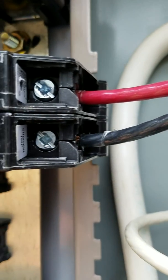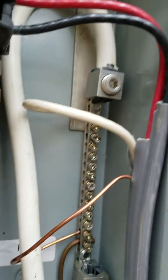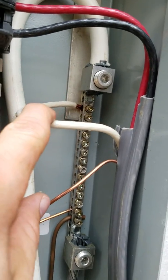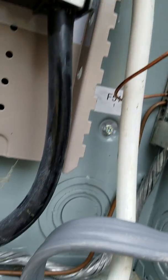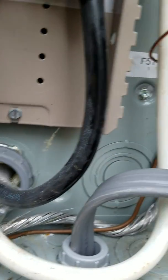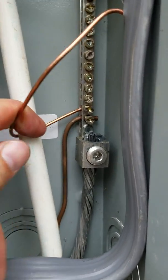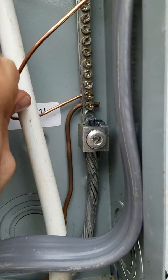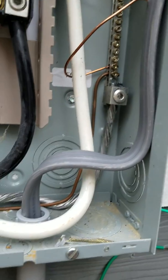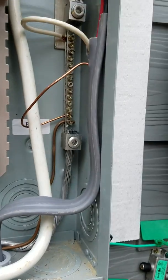That breaker cuts off power going down this bus. So a 50 amp breaker — red and black wire, see that. Your neutral goes into that bus, and that neutral goes inside to my next breaker box, my panel box inside.